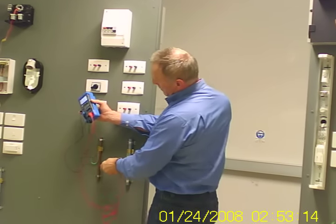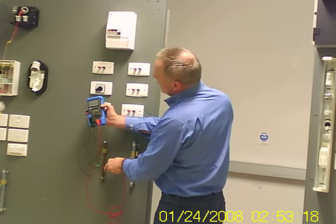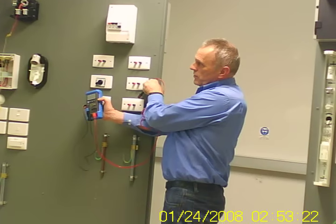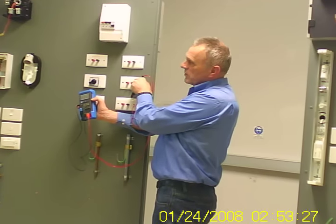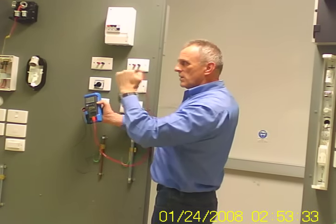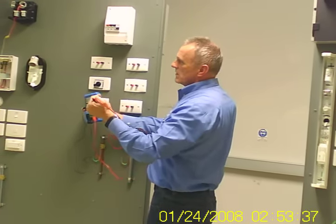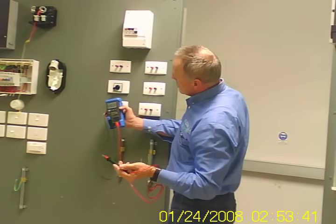We've got now 9.5 volts on our earthing system. Look, even the frame. And if your gutters and water pipes are connected to your earth, you get the same volts. Your meter box will have the same. And the greater the voltage, the current then too is reciprocal, and that's where the dangers come. So the greater the voltage, the greater the risk of severe shock.